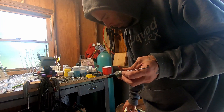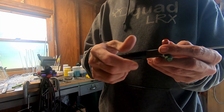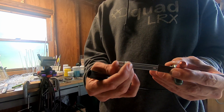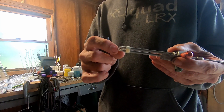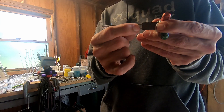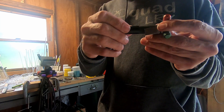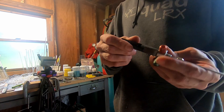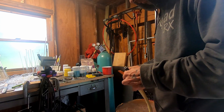Now tend to the torch. Got the hoses off of it. So now I'm going to screw this - I already did this but I'm just going to show you. This plastic thing was down here, and if you do that, these are going to have very little play. They're so close together that once you put the hose in there and have room from the hose clamps, they need a little bit of flex. So I'm just going to slide that thing up to give them just a little bit of flex, and then screw this handle back on.